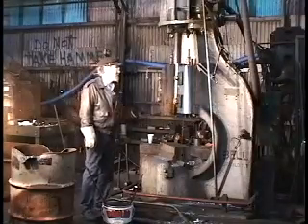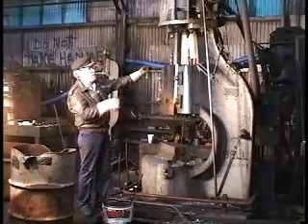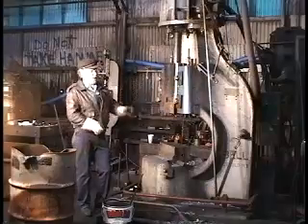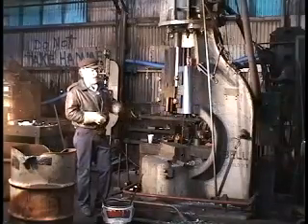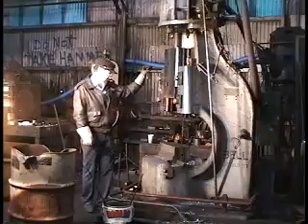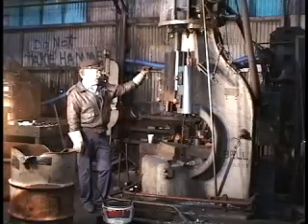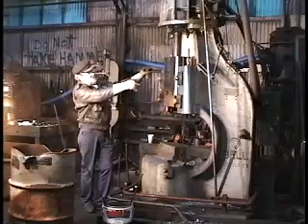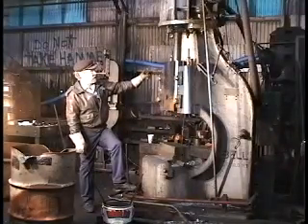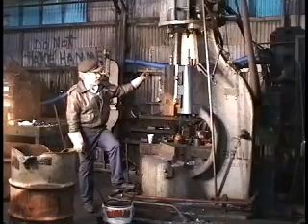I've made this one really easy to install. Besides the throttle control, I've moved the motion lever — which is usually driven by an operator using two levers, one hand on the throttle and one on the motion valve. With this, I've put a bell crank on there. You can see the motion valve coming out the side with levers on it, so I can control the stroke right here.